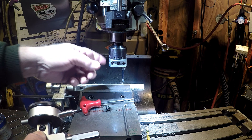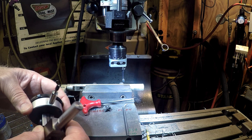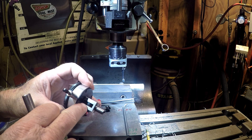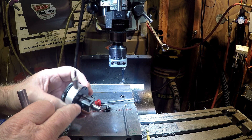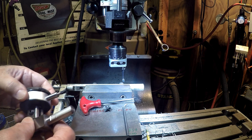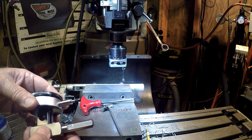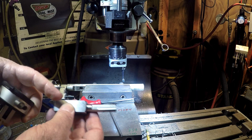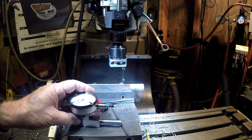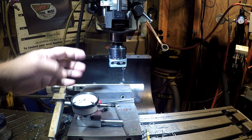Figuring out your height was fairly simple to do, then making your piece. Turns out it's 400 thousandths for the stem on the back of the indicator to the center of the hole. So that was simple to figure out. I think it's 850 thousandths total based on my bottom piece where I needed to be at. And of course it's reading radius.